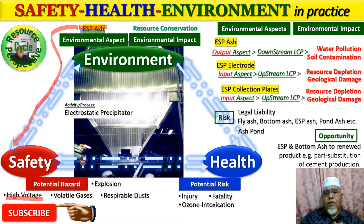Now, that high voltage, apparently from my understanding, and this is quite consistently told to me during all the audits, these plates have certain arrangements, certain morphology, certain shape. Good plates are where the end of the plate is rounded or baffled to ensure there is minimized occurrence of micro sparks, so-called, because sparks do exist in the operation of this equipment from time to time. And that is rather inevitable as far as I'm told.